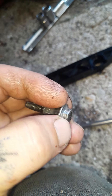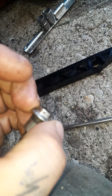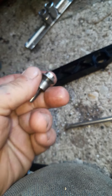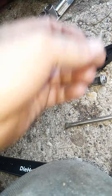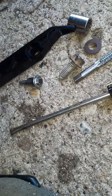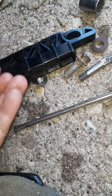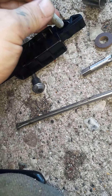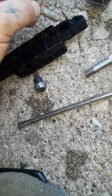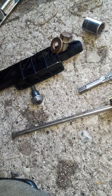The head was smashed on it and ground down. I actually had to use a metal file and bring it back to the size that it was originally — a 10 millimeter. The other bolt that I'm putting in there will be this one here; that's what I tapped it out for. That'll go into the other end here. I don't know if I should use the bushing or not — depends on the space. We'll let you know.